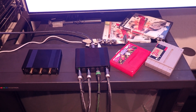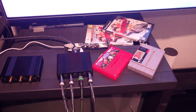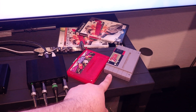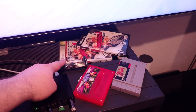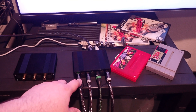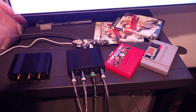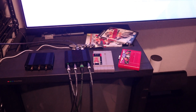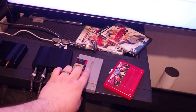By default, my devices had both detection options enabled, and I've found that I did not like the silence detection because it ran afoul of some of my games as I booted them. To run through some test cases, I have a physical copy of A Link to the Past, an SD to SNES that I'm going to leave at the boot menu, and then Burnout 3 for Xbox and PlayStation 2. I want you to remember: my computer plays the shepherd tone, this is my SNES with digital audio, this is my Xbox, and this is my PlayStation 2. Let's run through our test cases with the default configuration of invalid packet detection and silence detection enabled, and see why I think you should turn off silence detection. First up, a physical copy of A Link to the Past — that works just fine.